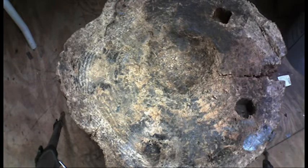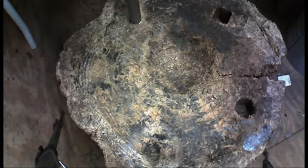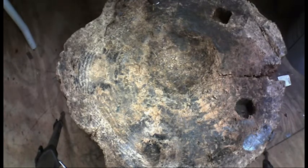The first most important tool you need is a dishing stump. It doesn't matter what surface you use - you can use a stump like I have here, a leather shot bag which is a heavy thick leather bag filled with buckshot, or the underside of an old welding oxygen tank. The underside is a nice bowl and perfect for dishing. They're a little bit loud, but they're great for dishing.